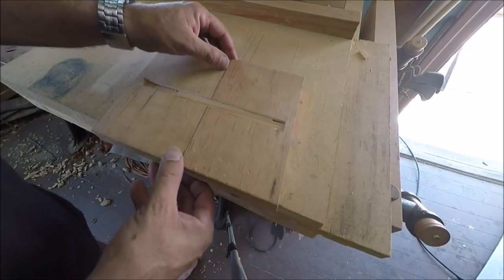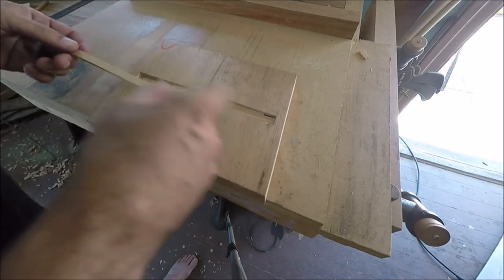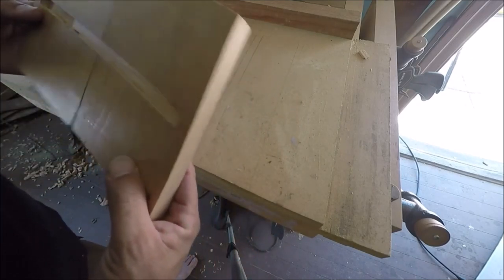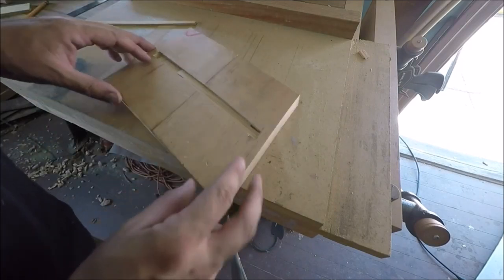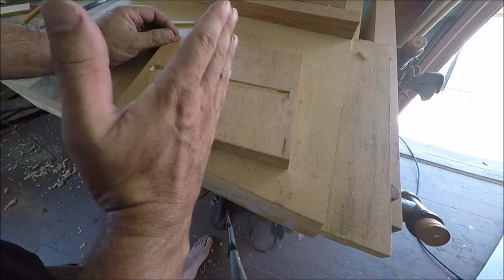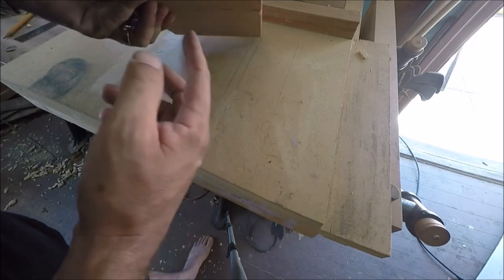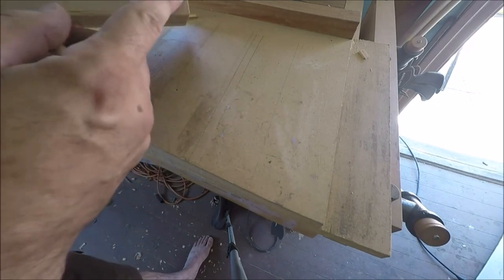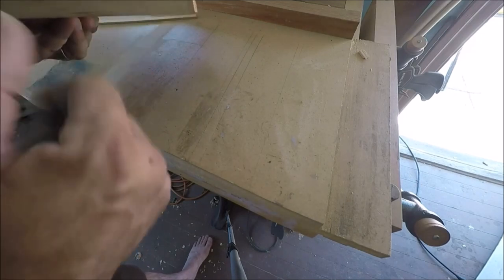Off camera, what I've done is cut a couple of pieces and planed a little wedge onto them, because I want those two pieces to stay in line and keep the dado aligned while I do more cutting. Now, if you remember, this is going to be standing vertically. What I need to do — and you'll see how this works later — is put draft on these side edges. I drew a little line here so I don't mess up when I cut it.